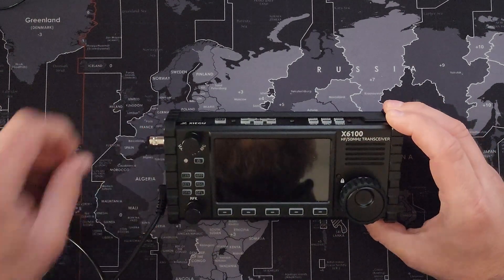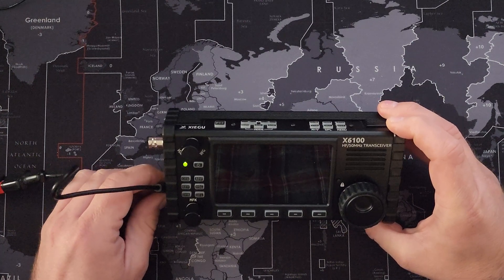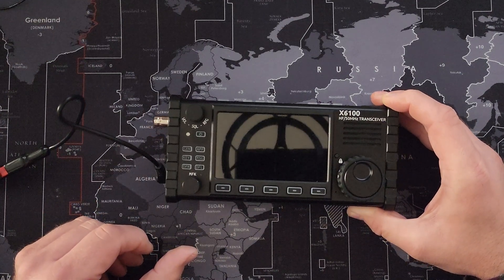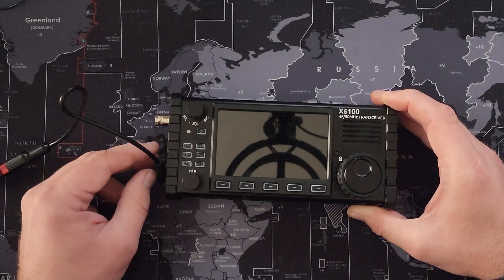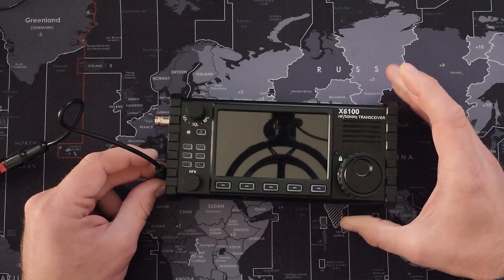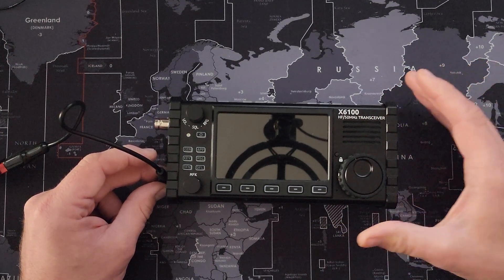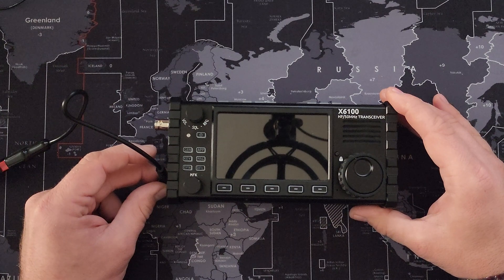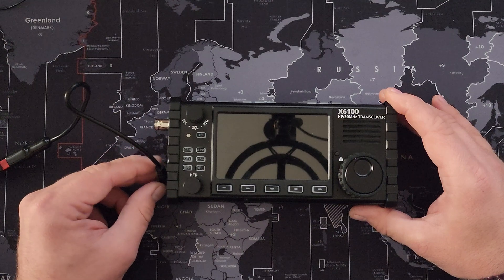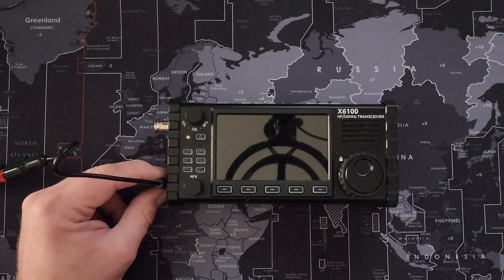Let me see if we can get this to go. There we go — as you can see, that's what was happening. There was a sweet spot. And that is actually charging the battery. So when he was actually utilizing it, he was going from 12.7 volts down to lower voltage, like 7.4, and thus losing his 10 watts of output power.